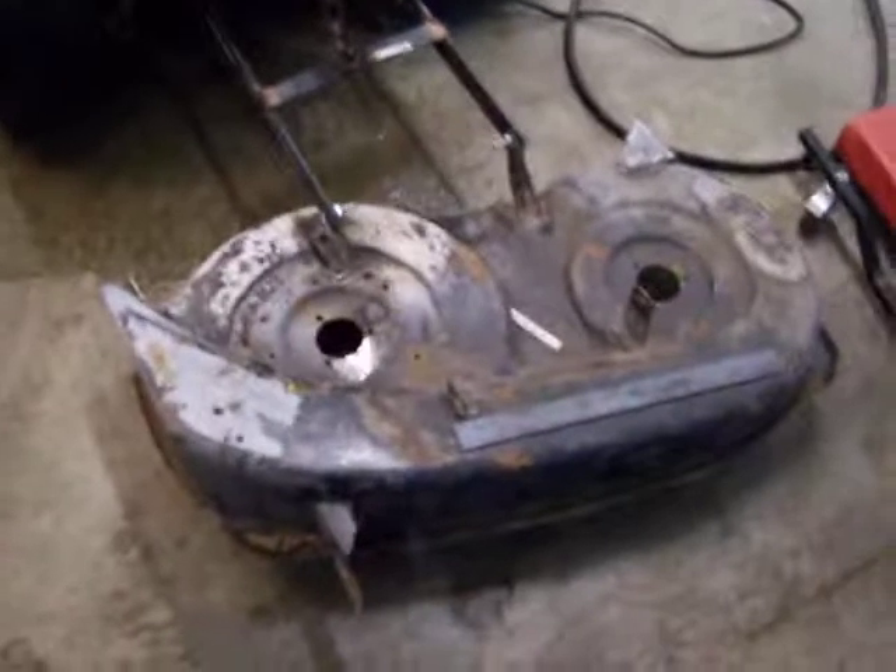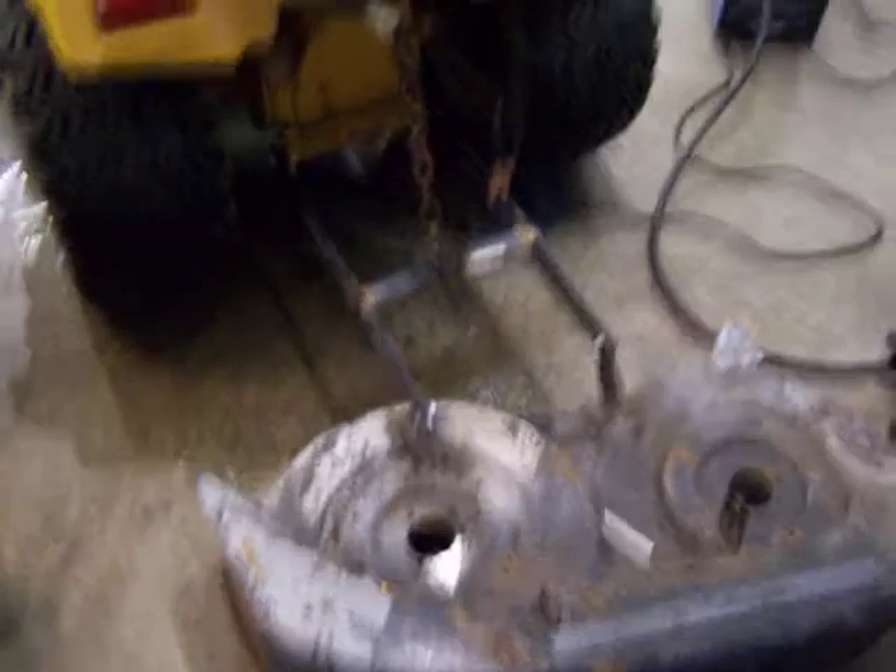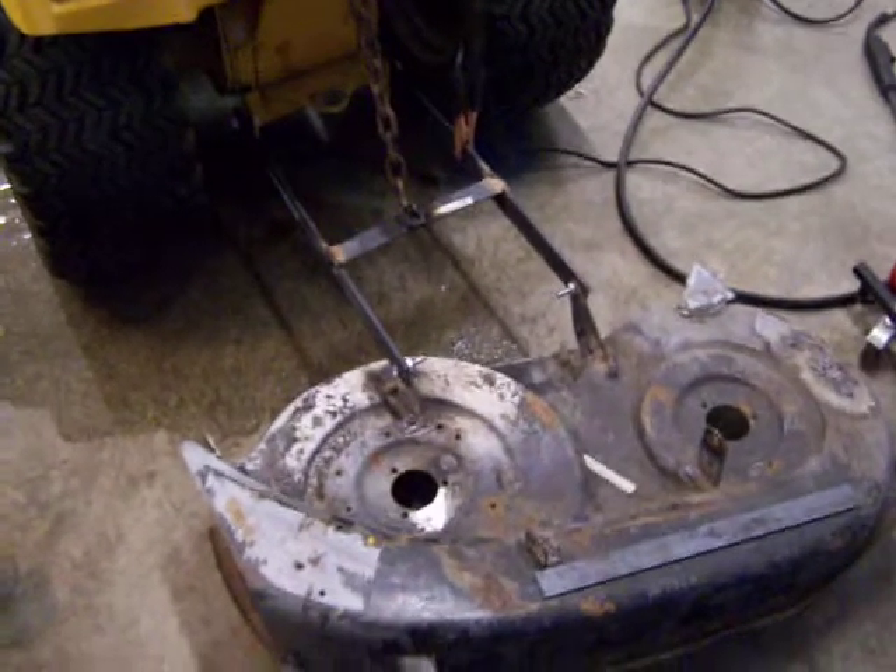This is my rigged-up back blade, kind of like a grader attachment. I had a wooden one before — instead of the struts being metal, they were wood. Since I got my welder, I got half-inch flat stock from Tractor Supply, a quarter-inch piece, and a chain that goes up here. Three-point hitch and you drill holes where the two-point is, bolt in back here.